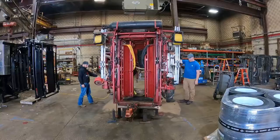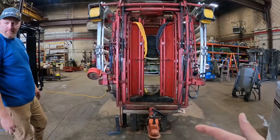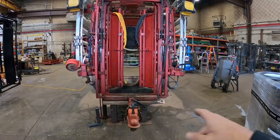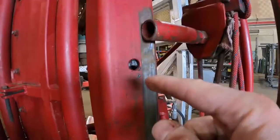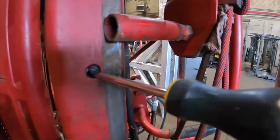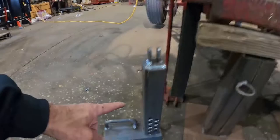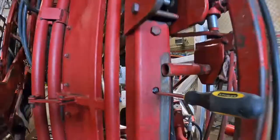Now we're going to lower it down onto the stands and retract the feet up inside. So now we've got the chute elevated on the safety stands. We've got the feet retracted — at least the feet that don't have broken springs are retracted. Now we're going to have to pull both of the feet all the way up and insert a detent into this hole — there's another little hole inside of there. We wanted to break loose this foot from the interior jack tube.